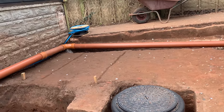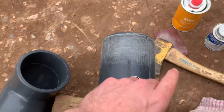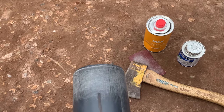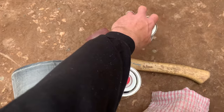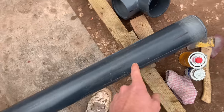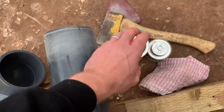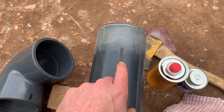I'm just about to glue on my 90-degree fitting. I've got my pipe marked, used a bit of sandpaper, given it a little burr off, and done the same to the inside. What I'm going to do is use this cleaning fluid to give it a good clean up, then put some of this Weld-On on it. I've set myself up on a little jig on my patio with a bit of wood behind the back so I don't damage anything. That allows me to sit on the pipe and really push it on in one solid hit, because this stuff sets off almost instantly — you've got to be quick and you can't make mistakes.